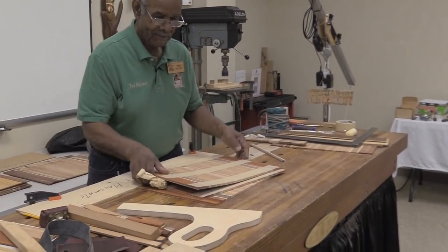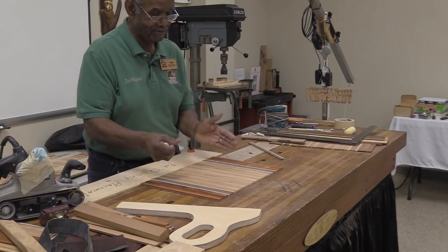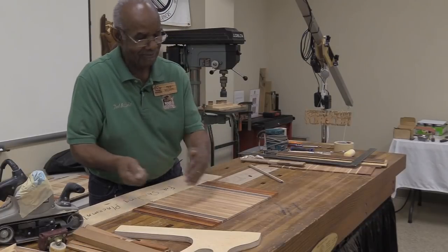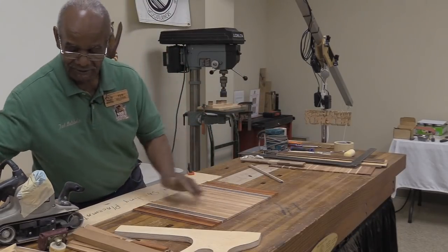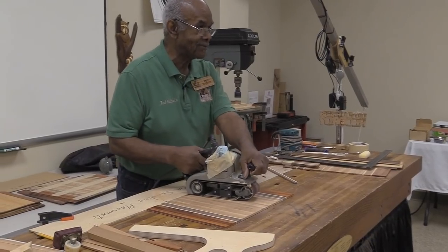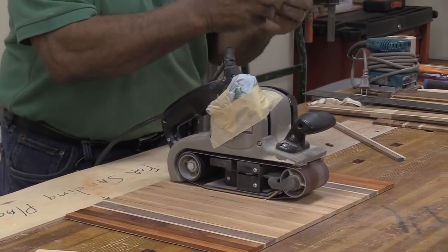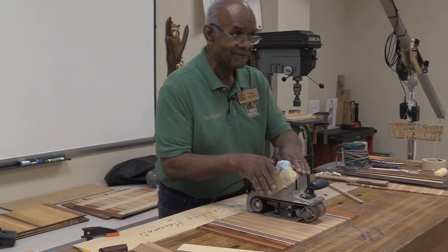I sand these with the belt sander. When I first got the idea of how I was going to sand these, I had no idea whether it would work or not. The first ones I ever made, I didn't spray lacquer on them - I used to put oil on them. I was scared to spray lacquer, I thought they would stick together. I only sand these to 120 grit - I don't sand anything past 120 grit. All of my tools seem to be wearing out after 30 years. I tried my belt sander yesterday and it started arcing fire - the brushes are just worn down to metal. So I borrowed this one, and we had to do a lot of operating on it.